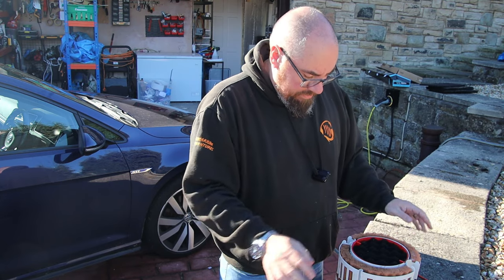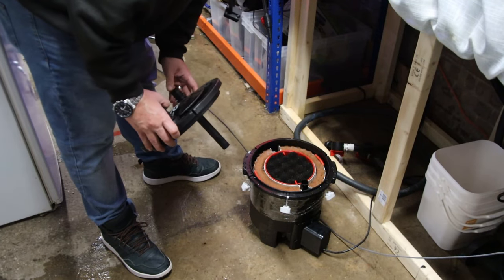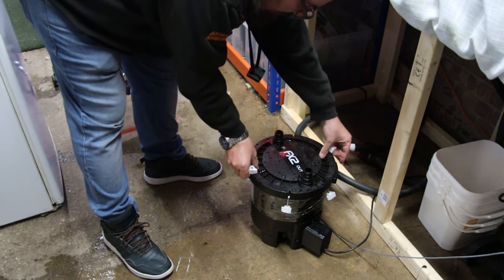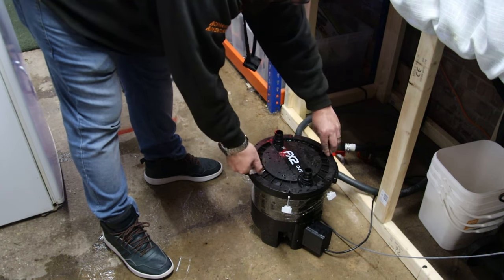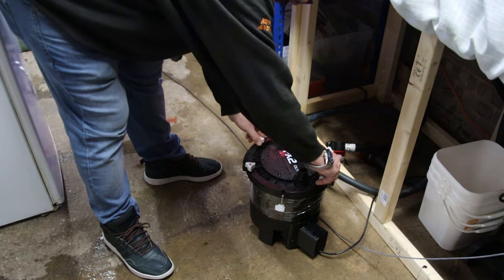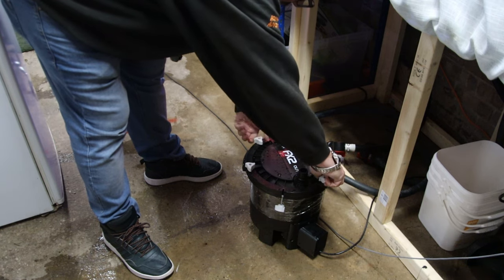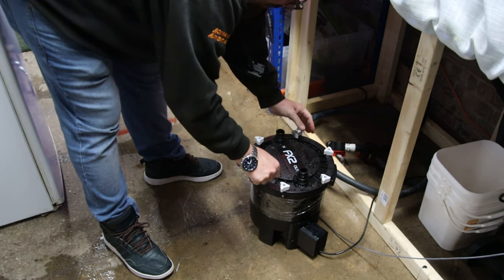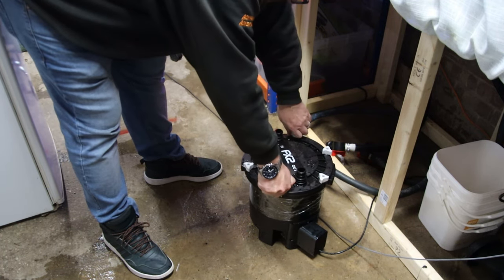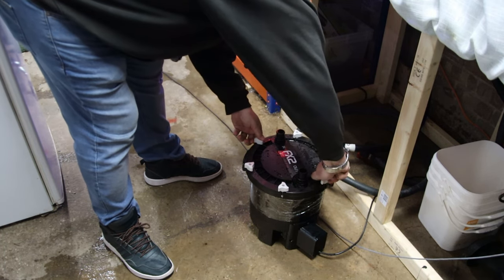Back in the filter. Fill it up with some water and away we go. Before putting it back in, slop on the lid and on opposite sides start to tighten it up — that way you don't get too much pressure on one side and risk pinching the seals. I've never needed any tools to tighten these up — just get them nice and tight by hand and you're good to go.